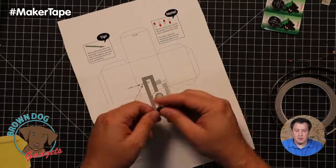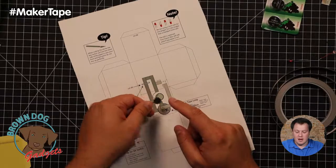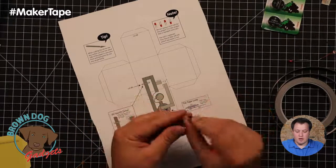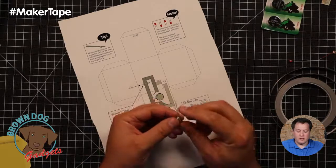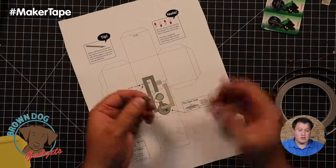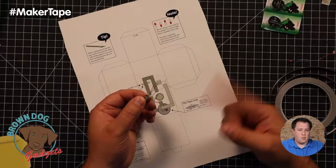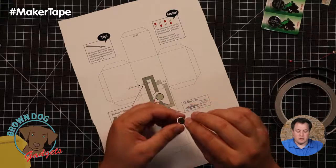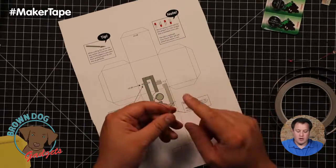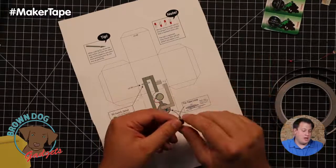We've got these tiny little disc motors that we use in all of our projects and kits. It's actually the size of the template. These are nice. We get these tweaked for us. They're sticky on one side, with a little pull tab where you can pull and stick to stuff, which is great for projects. You could use little barrel motors, but the problem is that little offset weight on the end would actually hit something. All the vibrations are internal on this, which is really handy. We also get these made with extra exposed wire on the end because stripping the ends is impossible.